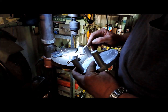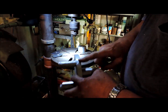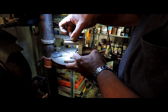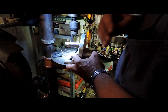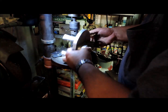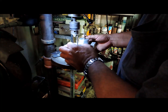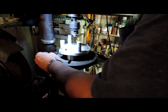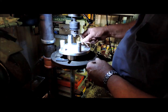To be able to get them in the right place we need to drill up from the bottom through there. The interesting part is I've only got about a quarter of the shank of a 5mm drill to hold on with — so let's see how we go. It's got the hub and the leg and they're not level unfortunately. This is the hardware I made up for other spacing jobs on this job, and we're going to bolt this to the table. The table rotates so that won't be a problem.